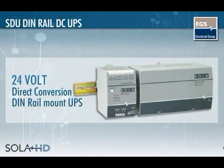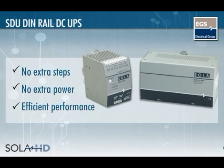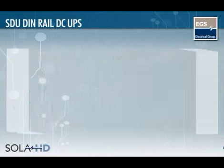Introducing Sola Heavy Duty's SDU DIN Rail DC UPS. The first modular 24-volt direct conversion DIN rail mount UPS system for the industrial market. Eliminating the extra steps, extra power consumption, and inefficiency of a traditional triple conversion AC UPS system.